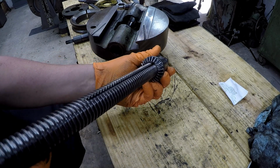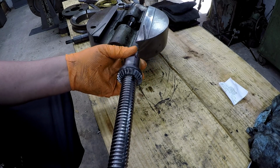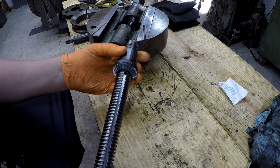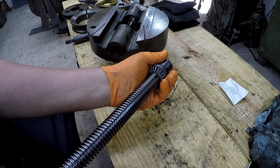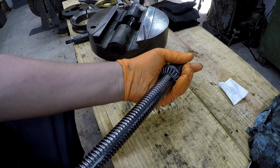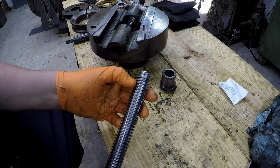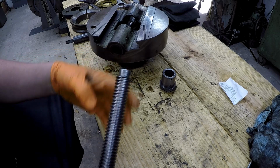So you just have a keyway. That's all it drives, is just a key. So that should be fixed to that shaft all the time, and it shouldn't be spinning through there like that. So that's what we're going to have to fix. It's got a ding or a flare or something out here on the very end, so I need to clean that last couple threads there.